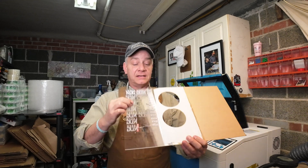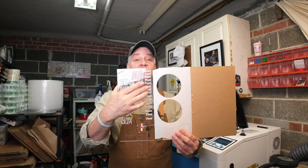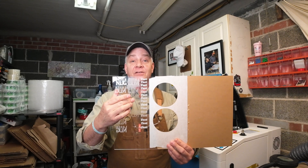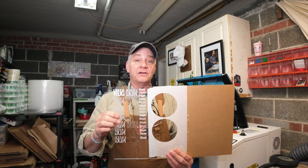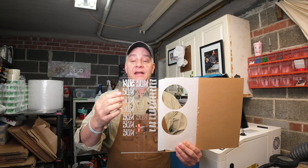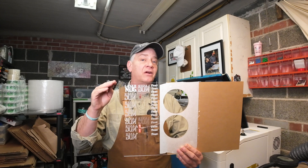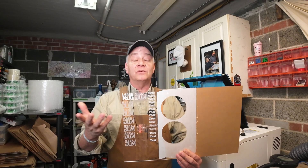So if you're looking for a nice clean engrave that's smooth and consistent, you can use a really high LPI — the bolt will go right up to 2000. But you're not going to get that white frosty look, you're going to get more of a transparent frosty look. Bottom line: lower LPI will give you more frosty, higher LPI will give you more transparent frosty, if that makes sense.